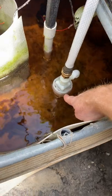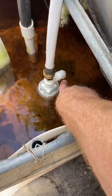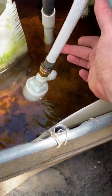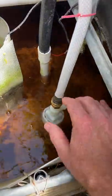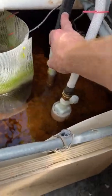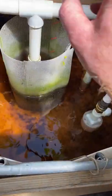What you're looking at here is a float switch — an automatic valve. When the water gets above about a centimeter from the bottom of that plastic cylinder, it shuts off. You'll notice there's no water coming out of it right now. But the minute the water drops below that level, it turns on. I have it set at the perfect height. If I demonstrate it briefly — see, it's running. I want to keep it in its spot at the perfect level.